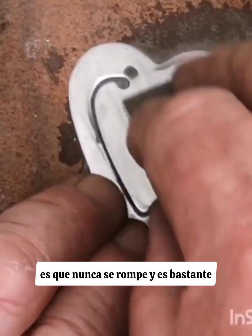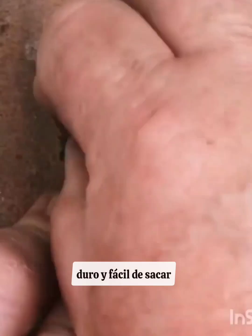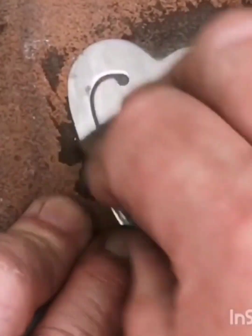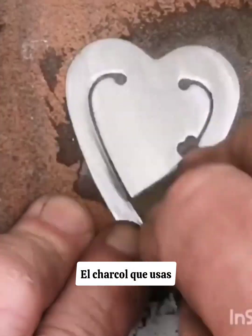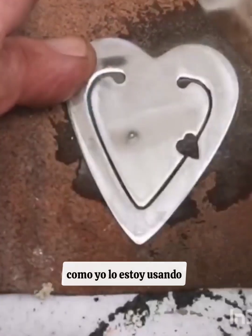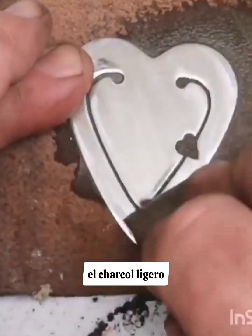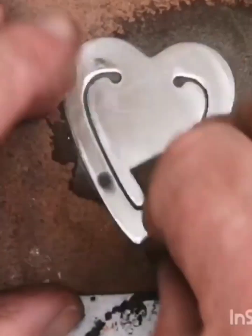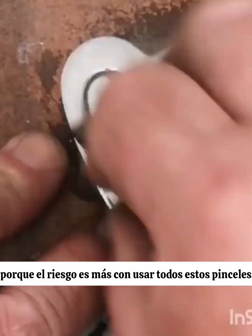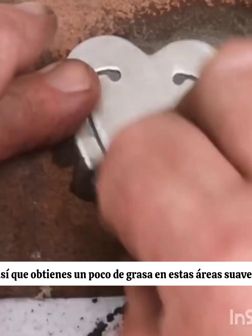What's quite good about it is it never really wears out, it's quite hard, and it's quite easy to get. You could also use charcoal — the charcoal that you use as a jeweler or silversmith — and you can use paraffin with it, just like I am. Make it into a wedge shape. I like the light charcoal. You go in opposite directions and it will remove these marks for you. There's less risk with this than using brushes, because brushes can put a bit of grain on flat areas.